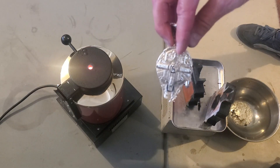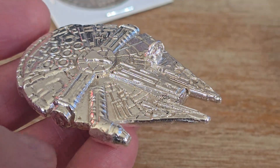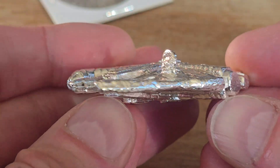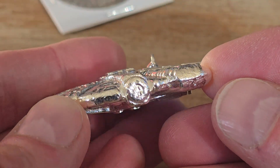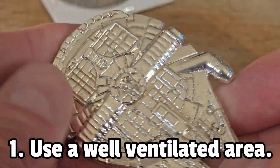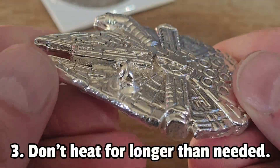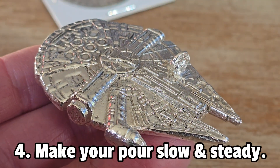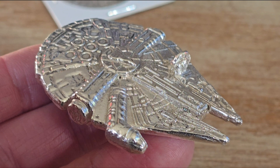Here is the cleaned-off final piece — I'll cut the sprue off, which is the extra silver where the pour spout is. I use a Dremel with a cutting wheel to cut the sprue off. Here are the key points: number one, use a well-ventilated area as this can give off noxious gases. Number two, wear proper protective gear. Number three, don't heat up your silver any longer than necessary to avoid breaking down the graphite crucible. Number four, pour slow and steady — if you pour too fast that silver can come flowing out quickly. Hopefully you enjoyed this video, thanks for watching.